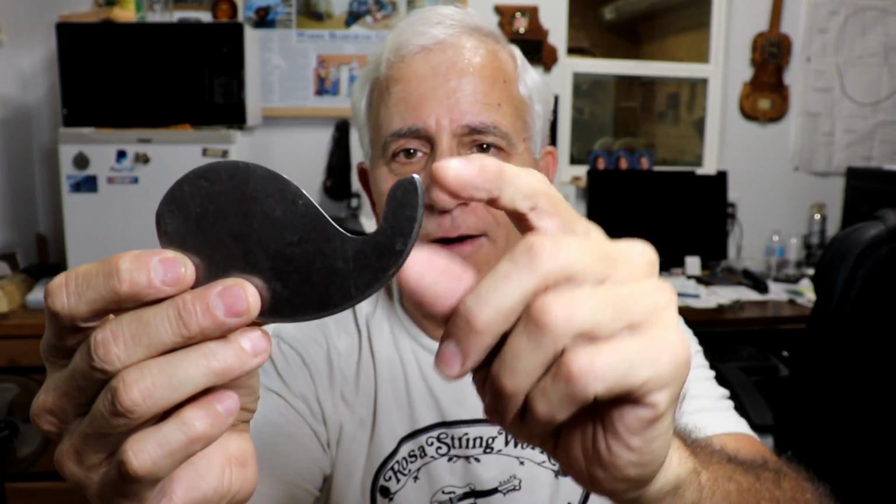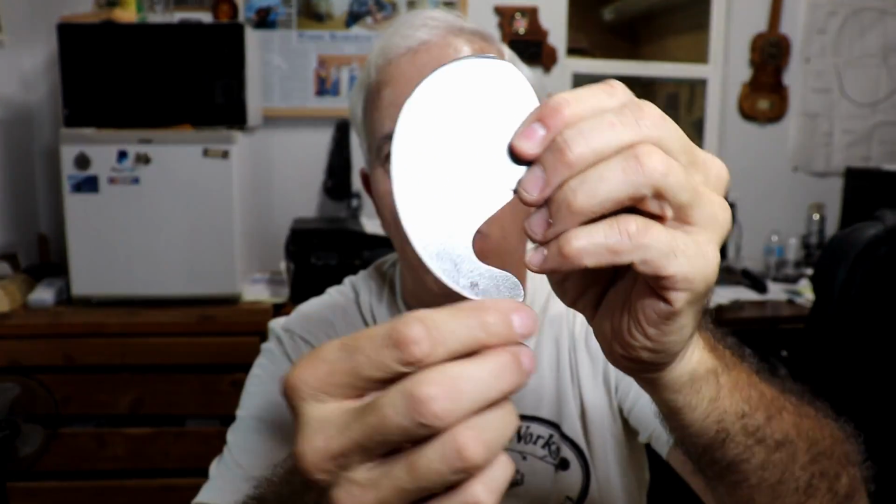The washer probably would even be more accurate, to be perfectly honest with you. This is just a modified tool. It's a cabinet scraper. It's about wore out now. I've sharpened it so many times. The way I do it, most people take scrapers and they block the edge, make it square more or less, and then they bevel off both sides of it with a burring tool. They take a burnishing tool and they rub it down and make the edge flare over on both sides.